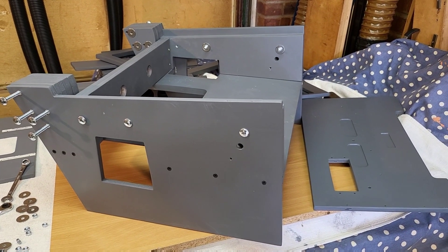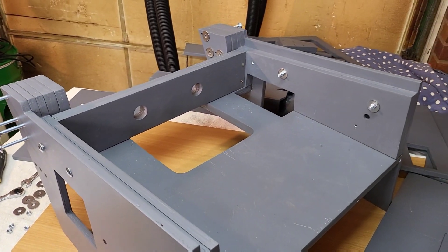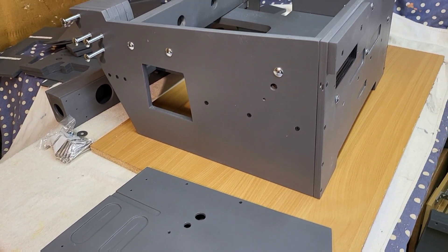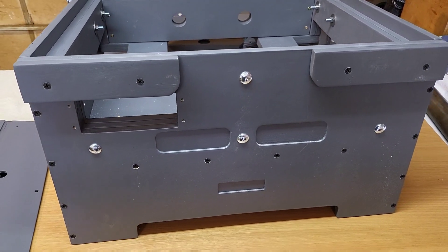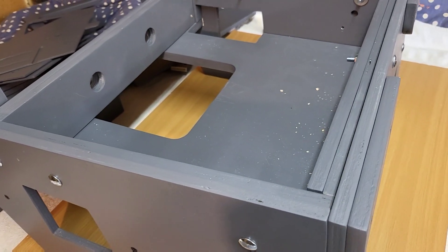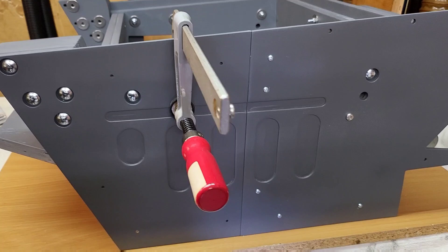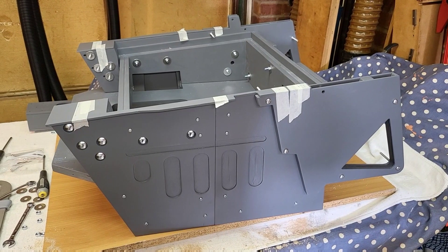There's a good few bits to put together for the base, but as it goes together I can really see that all that time at the design phase really has paid off, because everything just fits. We start to mount some of the skins now — they're the ones that give it some of the finished look and the aesthetic. We can see on the front here that rectangular cutout, which is where the switches that control the movement of the seat on the electronic base will be mounted. And also the tweaked design gives a bigger cavity within which I can route the tactile transducers and other items. The heads of those coach bolts sit nicely in the cutouts designed for them.